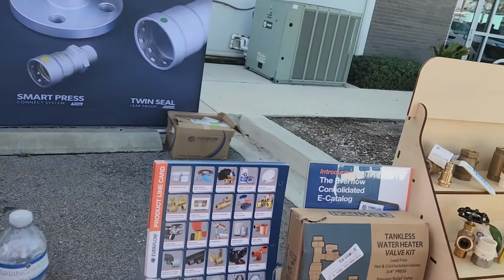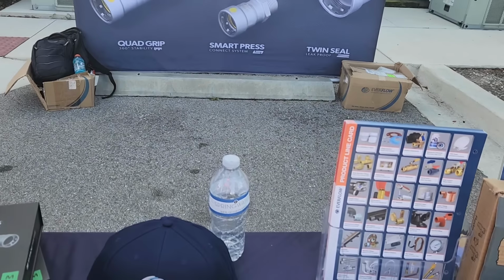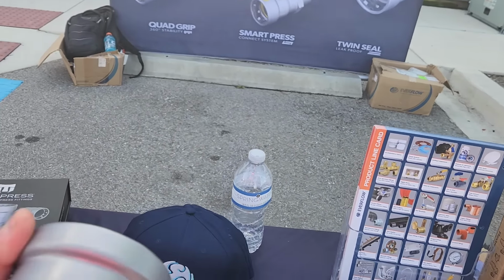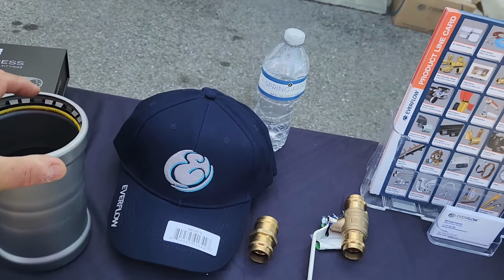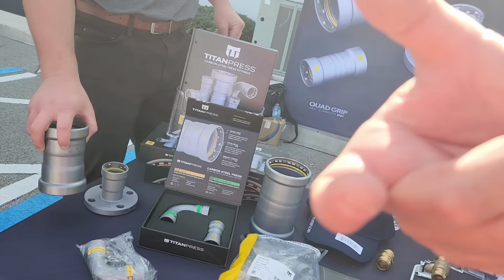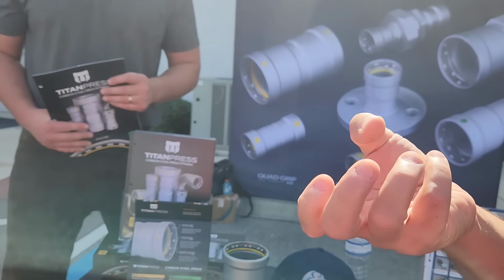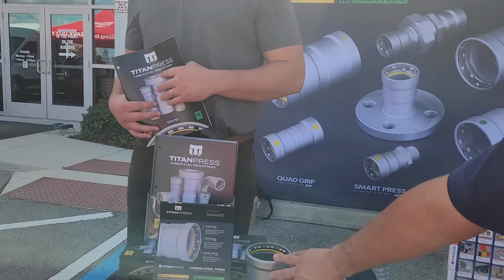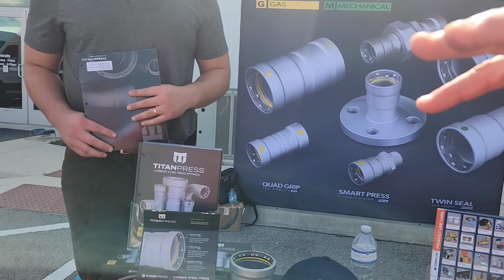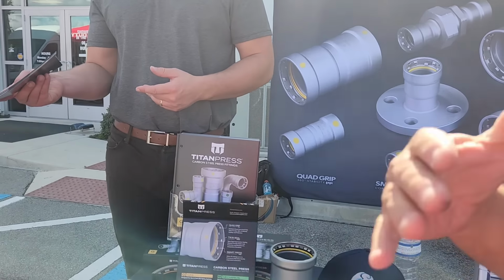The standard is welding or threaded pipe. And this is the crimp portion right here. It just wraps around that, and all you're doing is walking around. It seals. The tools are a little bit different on the smaller sizes, where you have to change the head. The knuckle is on the tool itself. When you get to the larger diameter, you put the knuckle around the fitting, and then the tool pinches down on one end of it. A little difference in configuration, but that's the way they get that hydraulic compression.